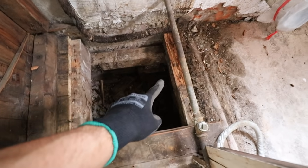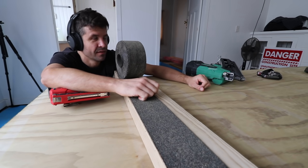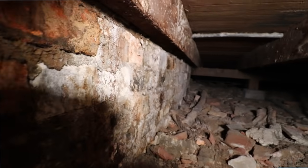We're fixing this. I've chipped away at pretty much all the rot, so that is all the rot and the wet spots gone. Now I've got a new fresh joist that I'm gonna make support the floor there. While the rot is gone, I kind of want to put something that isn't timber between this timber and the other timber. It's treated and dry now, so it should be fine, but extra precaution. I'm pretty happy with how this turned out — I thought that whole joist was gonna be wrecked and I'd have to find a way to get under there, support everything, pull it out. But it's only really the top of the joist that was damaged. I'm gonna add this timber just to be extra sure.